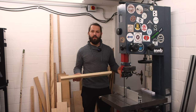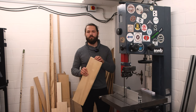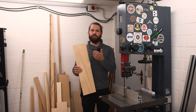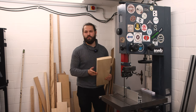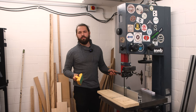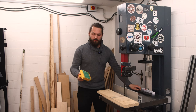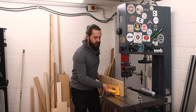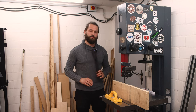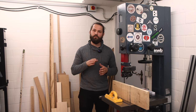As I said before, I want to end up with 8 millimeter wide Kumiko strips. So now at the bandsaw I'm going to saw it to about 10, 11, maybe 12 millimeters, and afterwards plane it to the final thickness. I register the jointed face against the fence and the jointed edge against the table. For pushing while re-sawing I like to use a push block at the side to hold my piece against the fence, and then when I come close to the end I use a push stick for the last few centimeters. When re-sawing I make a slow and steady cut to get a nice result and prevent the saw blade from drifting.